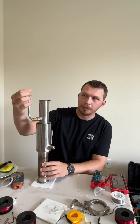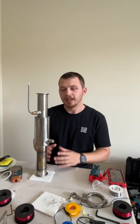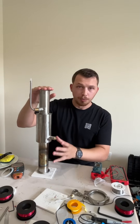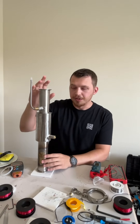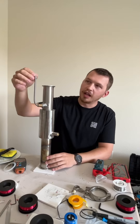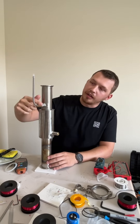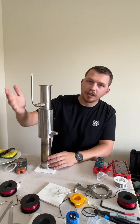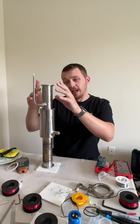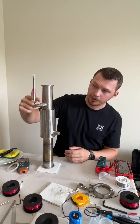I have a tube here with a small duck-bill valve. Any excess air—and by excess I mean as air is heated it will expand and take up more space—this allows the excess air to escape through the duck-bill valve without any air coming back in. This tube is very critical because the way this works is the hot air rises, and when it gets to the top it's colder relatively, then it compresses and falls. It's this constant cycle, and we're mimicking that cycle with this tube as well.